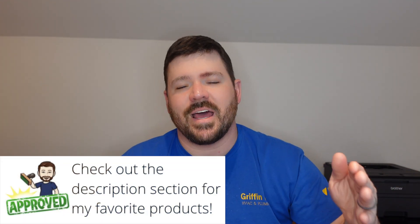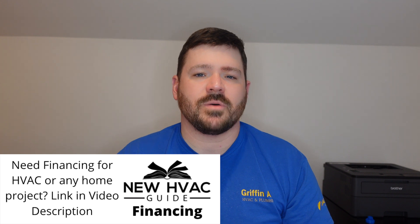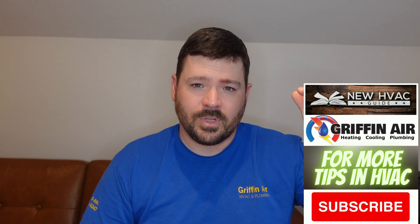Number 19: maximum temperature settings. A lot of thermostats let you program a ceiling and a floor — you tell the thermostat you don't want it going above a certain temperature and don't want it going below a certain temperature. Whether you have kids or just prefer it, you can set that thermostat so it never exceeds a certain set point. Some thermostats call these thresholds. Personally, when I install a thermostat in someone's home, I'll usually set a maximum set point of 80 degrees and a lowest set point of 60 degrees, keeping the customer within that range.